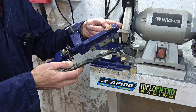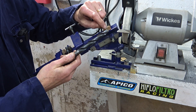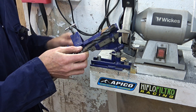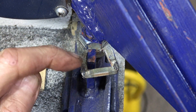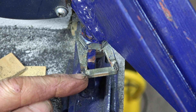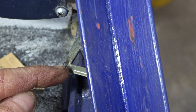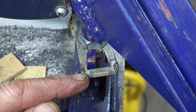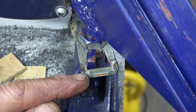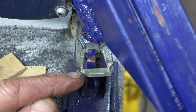Now, there's a peg here which is used to locate the flute — to keep the bottom flute and top flutes vertical at the point you're setting it up. Here's an important point: this peg and this plate with a hole in it limits the movement of the drill. So you're starting here and you move across to here. I've seen various smaller grinding jigs that run right across the face of the wheel — almost a 100-degree swing — but I just could not get that to work with these. So the swing on my jig is limited to this.